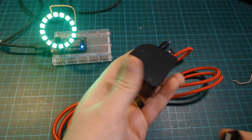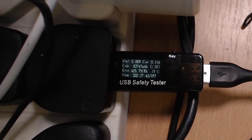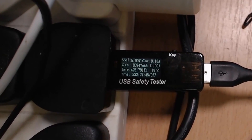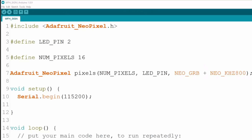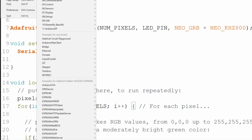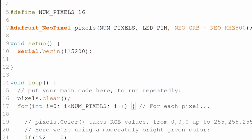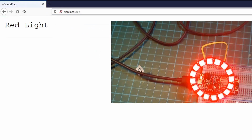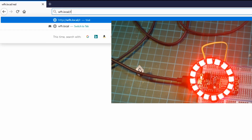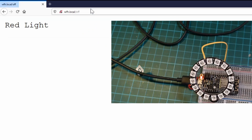I then decided it'd be a good idea to test the power draw, and I used one of these USB power testers to do it. I don't even know why I did this — I didn't use it for anything. I'm sure if you're familiar with my channel, you know that an ESP8266 can host a web server, and I did that using the example project HelloServer. I modified it to have different endpoints to set the different colors I wanted, so I created a red one, a green one, and an off one.